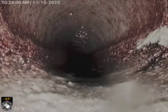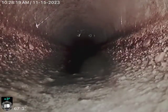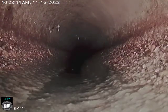Do you have any questions as of right now from what I've shown going out to the system? So that was at 75 feet, and there appears to be some roots up to about 67 feet. This right here kind of looks like a spiderweb to me. With how light it is, it necessarily doesn't look like a root. But this one right here, at 65 feet at the top — that's definitely a tiny little root just penetrating through the system. So that's 10 feet from the city line, which is probably in the middle of the street.